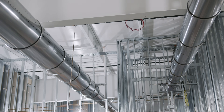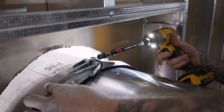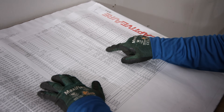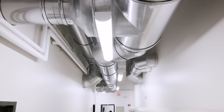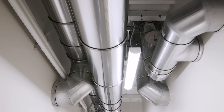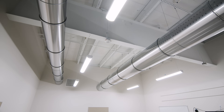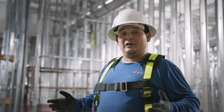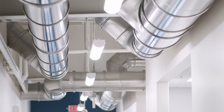There are some tips to remember when installing this duct work. The most important thing is don't forget your gasket. Make sure all your hangers are lined up real good. Keep your big clamps at 12 o'clock and remember to use all the tag numbers on the duct work corresponding to the prints. I've been installing duct work for about 19 years and I like the way this duct work has been designed. It's very versatile — definitely a better and quicker installation than Spirro, a whole lot easier because you're avoiding all the crimping and other stuff you have to do with Spirro. It's just like building a Lego set but in a bigger dimension. I like the result: shiny, industrial looking, and it's pretty clean duct work.